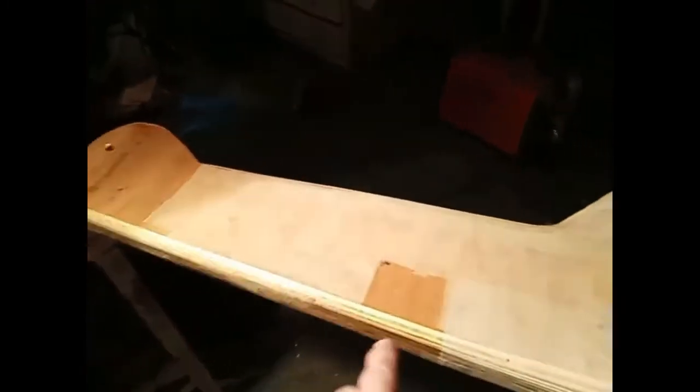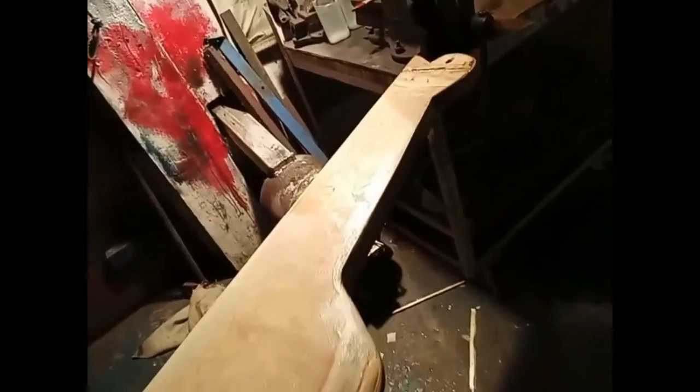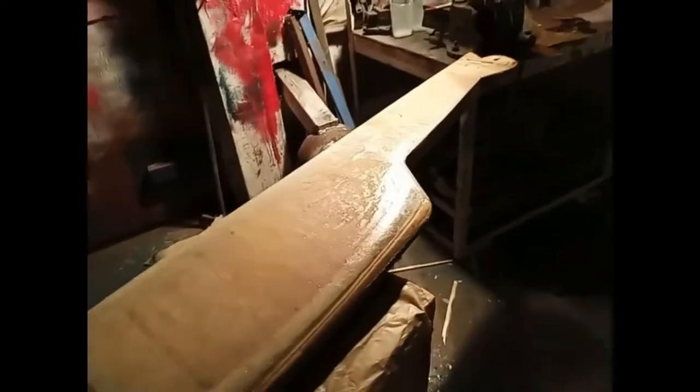And you can see that's where my transom's going to go. The top is going to be painted anyway, so it'll be safe. But all this is going to have another coat of clear, not gel coat like what I've been using, but fiberglass resin. Anyway, there it is. I'll come out in a bit, sand her down, and give her one more coat while she's stood upright in the vise. And then tomorrow, final sand down, she's ready for painting.